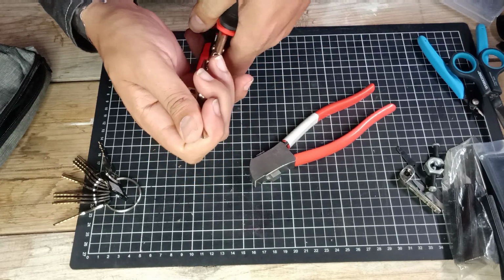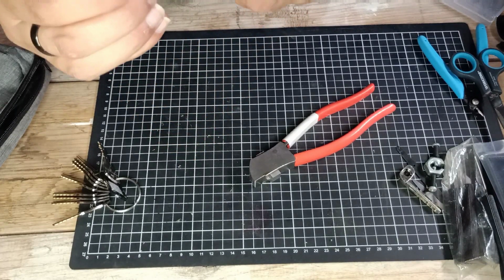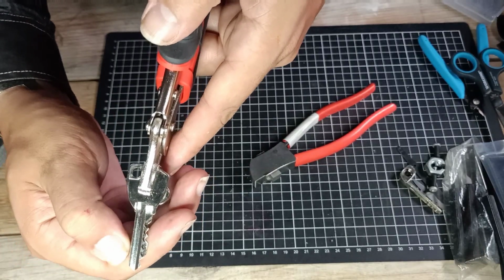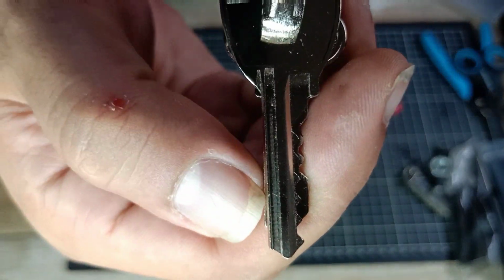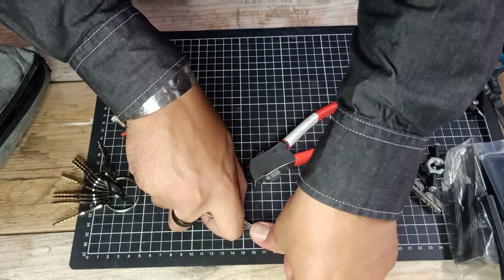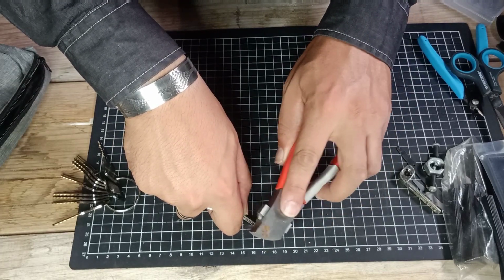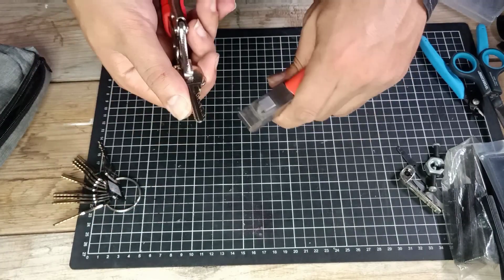Alright, I'll loosen that off a little bit. Sometimes when you clip with the vice grips, it will turn the key just at the tip there, which it kind of has just a little bit, like a thumbnail's worth. Just here. Try moving a little bit closer, you can see, so that will throw your key off quite a bit. So I normally just push it like that and try and really get that. There we go. Now it's nice and flush.